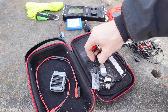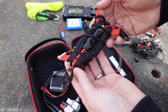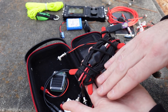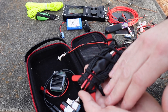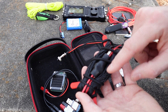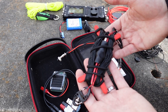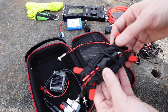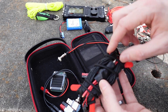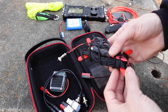For the remainder of the kit, the most important pieces: I have a linked EFHW half-wave antenna. Half of it is for 20 meters and the other half is for 40 meters, so you can deploy just the 20-meter portion or the full length of wire to get on 40. At some point I'll probably break down that 40-meter section and make it 30 meters as well for more optionality. Today I plan to get on 20 meters, so I'll just deploy half of this wire and leave the other half on it.